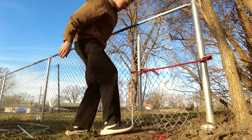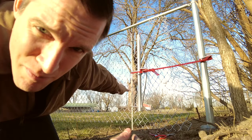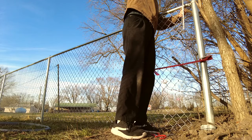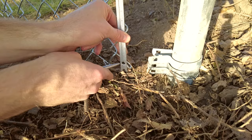Since this is the last stretch, there's going to be a little more give because there's slack between here and the terminal post — so it should be a little tighter on this side. The tightness combined with the slack of that side should make it about the right tension. Some tension bars have a little hole at the bottom. If yours does, you can bend open the bottom loop to help make sure the tension bar won't slip down.